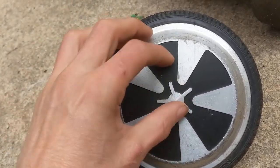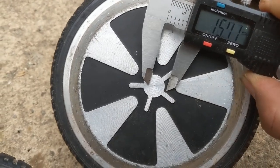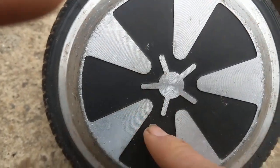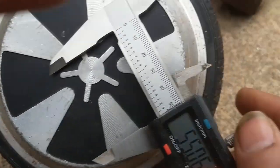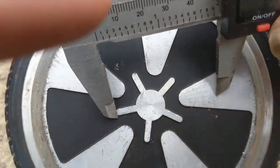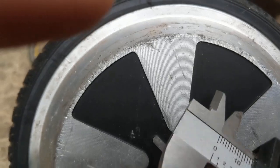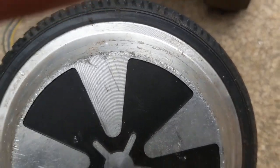You can easily make five holes here. You can simply measure — that's 15 millimeters here, and 10 millimeters there, so it's 17.5 millimeters from the center. You calculate the radius of the clutch, so the radius is 17.5 millimeters, and you can fasten it there. You can make markings from here to the black side — the black is easier to see. Then you make a distance marking from this side, and once you have that cross you can easily make the five holes to fasten it.